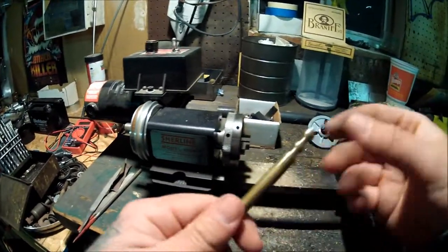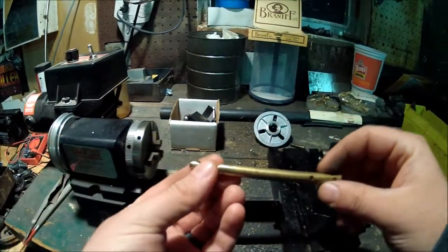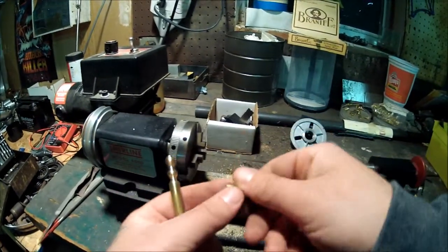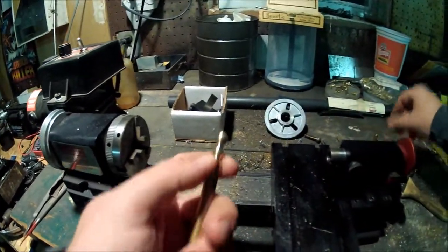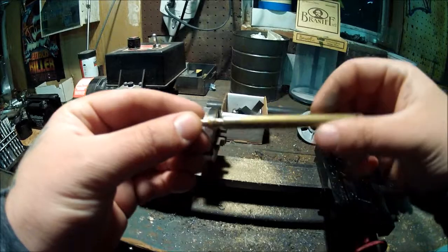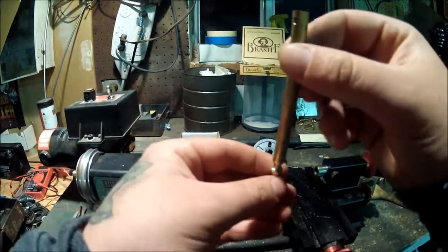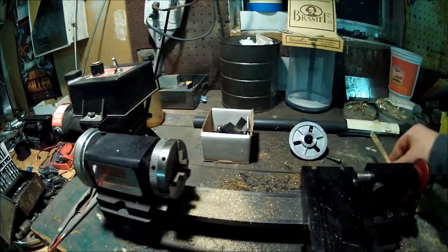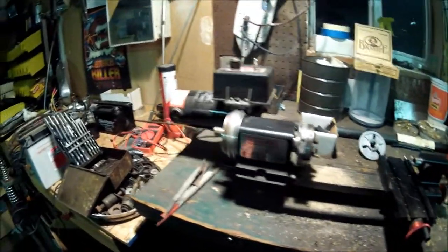Something I've done in the past is made a block to screw your part onto, so if you've got a shorter piece like this, you can screw it on there and work off of that — so you're away from your chuck a ways but still holding it pretty tight. Anyway, that's how you can do some nice round little carving. I used a softer material; steel I've done too, but it takes a long time. Good fun little project, something a guy can play with if you've got some material and a spinning machine like this. Thanks for watching and we'll talk to you all later.